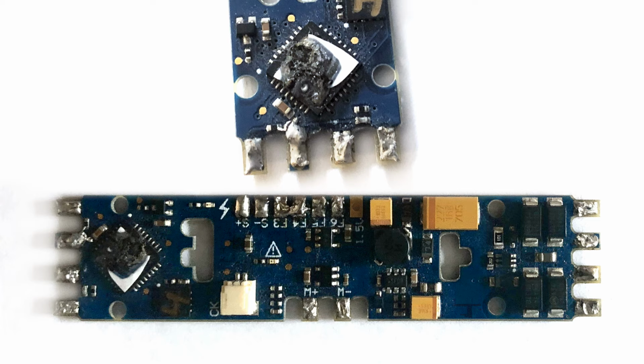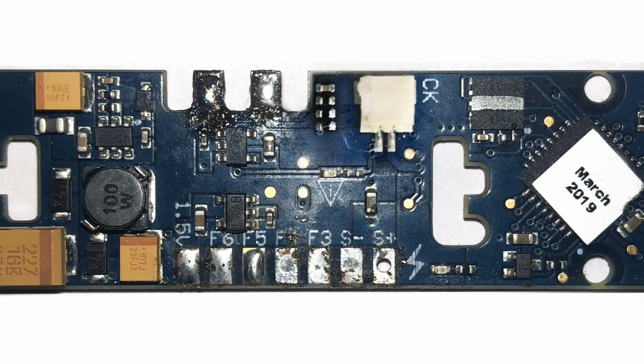Third example is messy soldering. If you look closely, you can see that there's some solder that got on the processors, and also sometimes we get it on the components at the end. Our fourth example is excess flux, or possibly the wrong flux. If you have excess flux, you can get moisture into your board. If the wrong kind of flux is on your board, which is the zinc chloride, it actually corrodes our components,